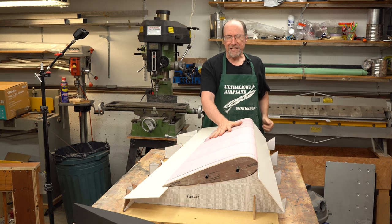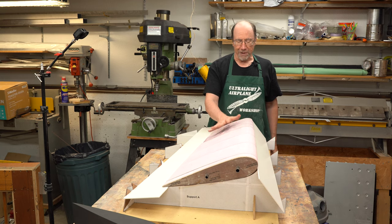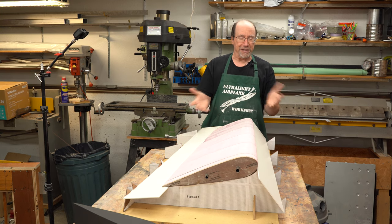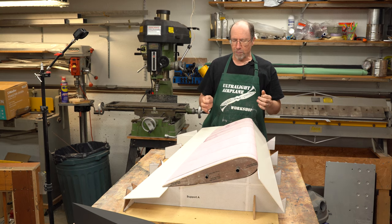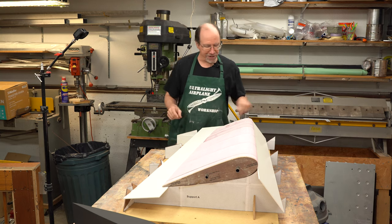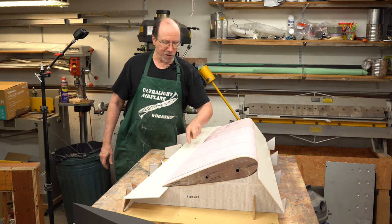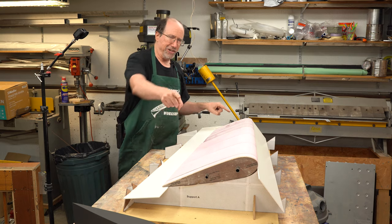As you can see, this is the old plug that I made for the rudder for the UWS1 ultralight airplane. I'm really glad I have this now because I can use it to do test fitting on this fixture without scratching up my good plug. This is the partially completed test fixture for making a skin mold. What we want to do is have flanges all the way around our plug. When we lay down the fiberglass for our mold it'll go from flange to flange and from plug extension to plug extension.